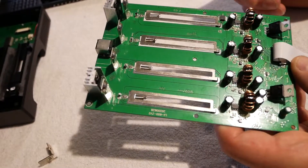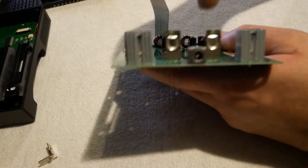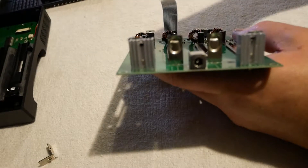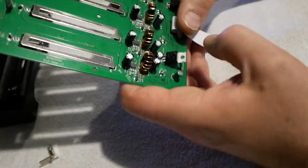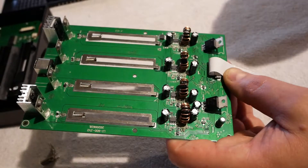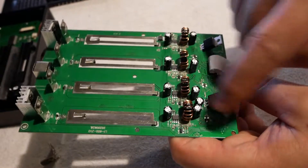It does look like it has more ripple protection, but not really. On the 500S you had 12V in with a capacitor there, then a little board and a USB port providing a 5-volt charging port — all of that has been removed in the 600, and now there's no capacitor over here. They've basically moved it — now you've got some more capacitors over here, basically controlling ripple on the four little DC-to-DC converters. That's good that it's there because it's not there on the 500S. And then you get a bit more capacitance here.